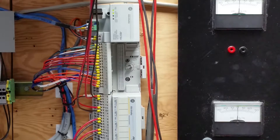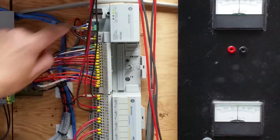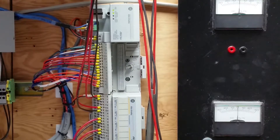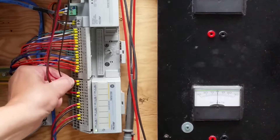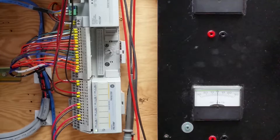Here's our setup. We've got our ASB connected to the remote IO link — this is just an empty slot for now. Down here in the bottom is our four channel OE4, and it's currently wired up according to Allen Bradley specs for the current output. I've got it set for 4 to 20 milliamps, and you can also set it to 0 to 20 milliamps depending on your situation.